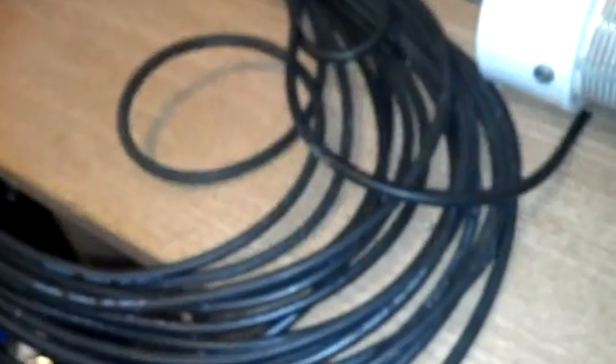Now I've got a coil of coax here to make an air coil choke. I'll have to look that up and see what it is, but I'll make it a perfect circle — I think it's a 10-inch circle with maybe 18 feet of coax — then I'll put in zip ties, make it all nice, and then go ahead and install this outside and see how it works.